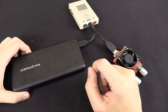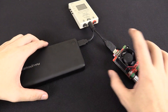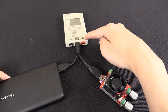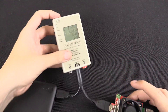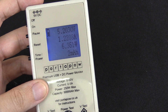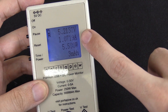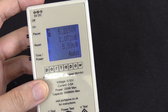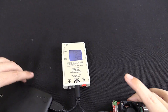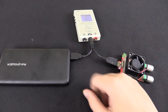Let's point the camera down and take a closer look at this power bank. Now it's time to test if the advertised capacity is true. For that we're going to use my USB watt meter and USB dummy load. I'm going to set this to 1 amp — 5.2 volts, 1 amp, around 5 watts — and we'll leave this to discharge and come back when it's finished to see the true capacity.